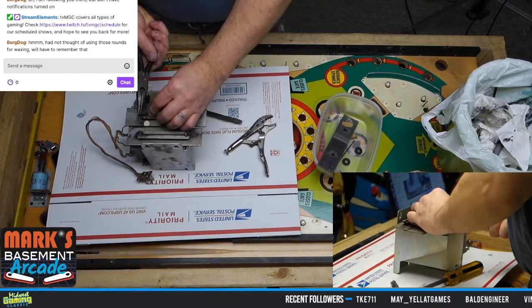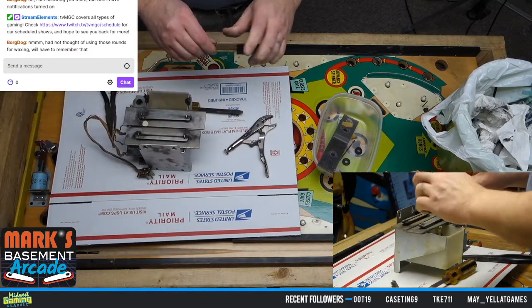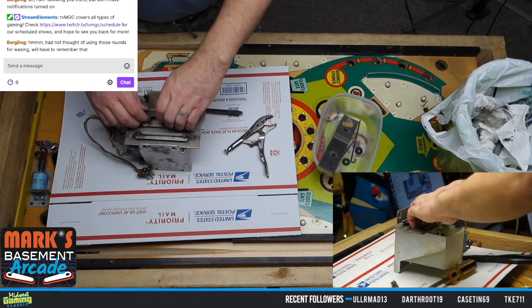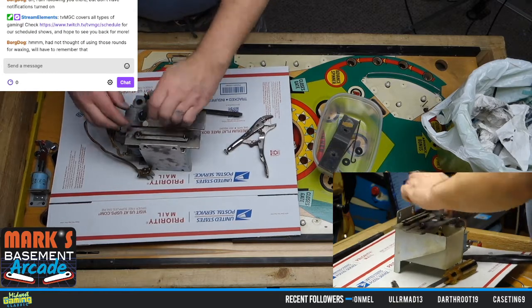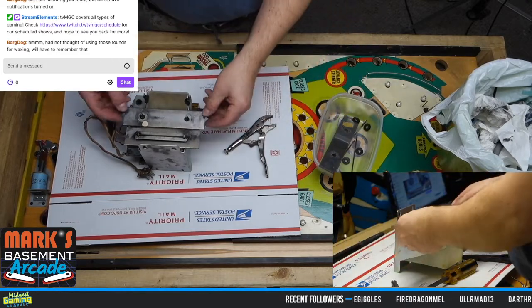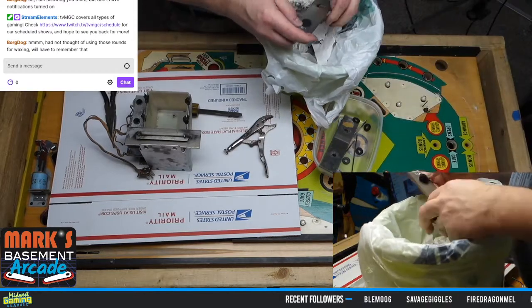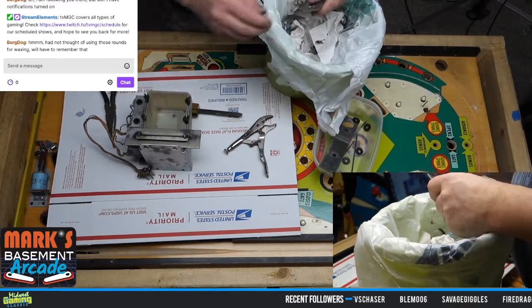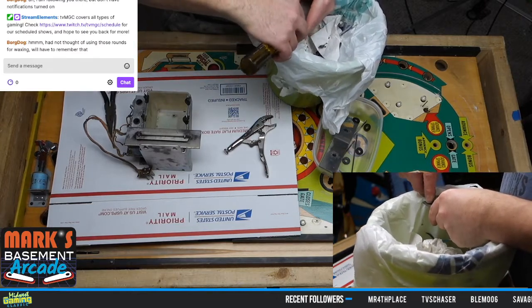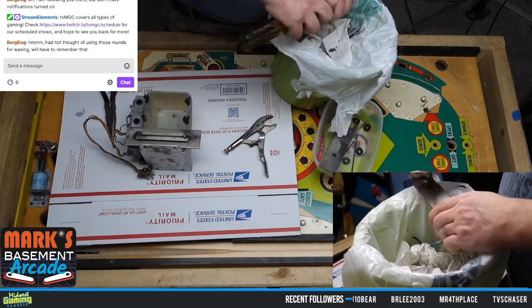And again, take that, slide that out. This is actually bent a little bit. I don't know what these are made out of, but man, they're very strong. I will show you how I rebuild chime boxes too. These washers are saved. This comes out. Then we got more of this petrified old rubber. I do not like this rubber that they use. It is the number one fail on all chime boxes. It's what makes Williams chime boxes sound like total garbage.